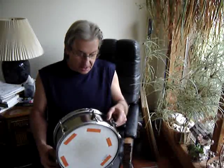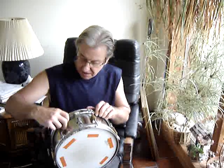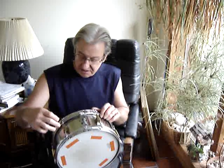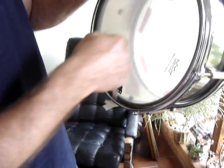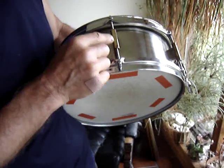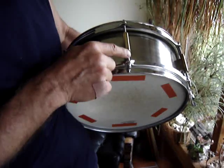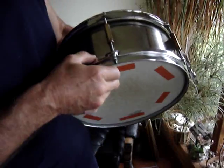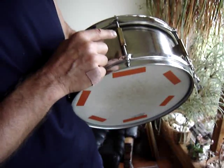I made this piece to clamp and hold the other side, and bolted it all on. The lugs are brass. This is a half-inch rod, and then a block underneath — I had a cutter radius to saddle them in. There's one bolt going from the inside all the way out, screwed right in there with a 1/4-20 screw, coarse thread. That's a 12-24 thread there. I had to buy the right size screws and a tap so they didn't hit together in the middle.